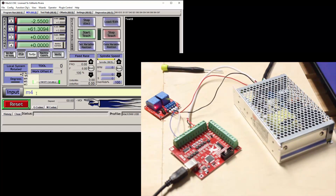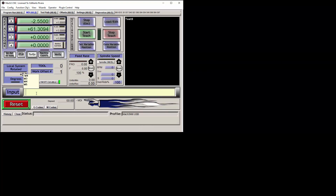You'll notice that Mach3 automatically turns off M3 when M4 is invoked. This is to ensure that the spindle does not have forward and reverse activated at the same time. Go ahead and play with the various combinations of M3 and M4 to turn the relays on, and M5 to turn them off. The relay output connections can now be connected to the variable frequency drive signal terminals to control the forward and reverse operation of the spindle. This is how to configure the Mach3 USB outputs and connect the outputs to a relay. Thank you for watching.